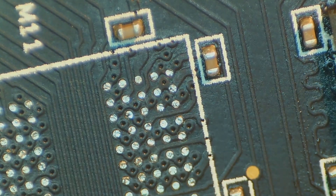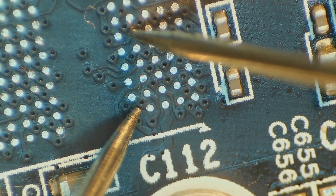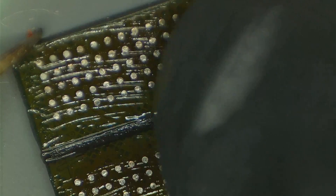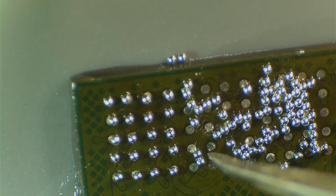I was going to place an order for a new VRAM chip, but since the measured values are good, I will try to reball the chip and test first. I have a bunch of reball BGA stencils, but did not have one for the 0.4 millimeter pitch, so I will have to place the solder balls manually. I smear a thin coat of flux onto the chip, then pour some solder balls and move them into place using tweezers. This is a tedious process, so I will speed it up.